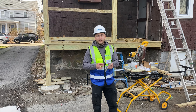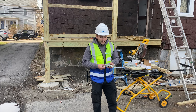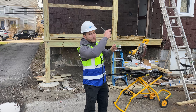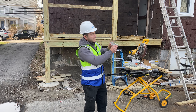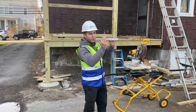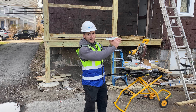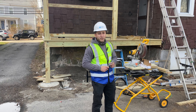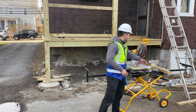When you install this tension kit, you leave 2 feet on the right and left side and start to install the first one. From there, every 4 feet you install another tension kit. When you install it on top of the joist, you leave 2 inches from the top, install it, and then you can screw the pole through the ledger attached to the house. That's how you do it.